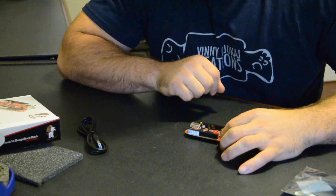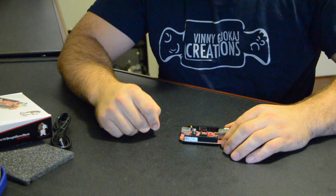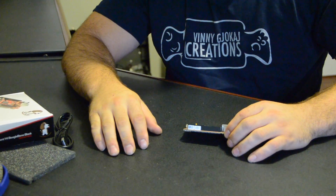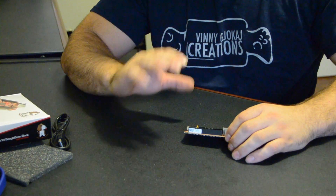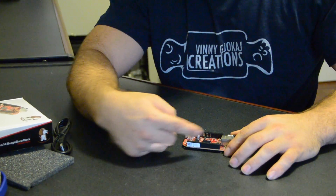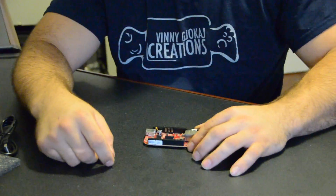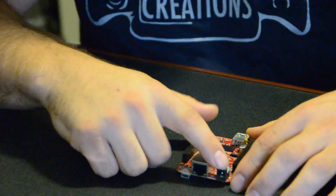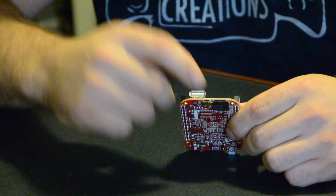So I've been looking into these real quick. What I know is that they use the TI Cortex A8 one gigahertz single-core processor. One thing I really like that really caught my eye is that it comes with four gigabytes of storage with Debian Linux installed already, which was pretty nice. They have two 46-pin headers with 65 GPIO pins total, an Ethernet port, a 5-volt input, a USB host, and HDMI with a microSD card.